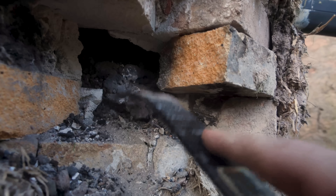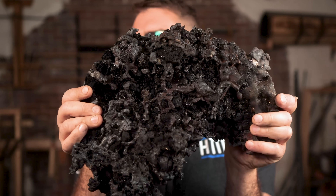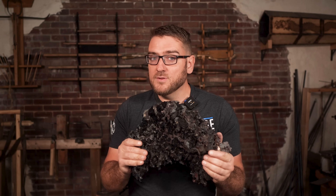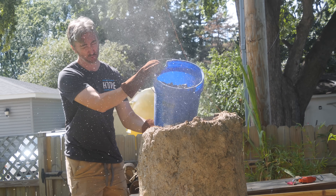We were able to do our first attempt at cast iron, and for the most part it went pretty good, but we did not get a castable result. I dug out the bottom of the cupola and got a mass that's not quite the shape I was going for, but it's definitely something. I think this is all 24 pounds — it all definitely melted and formed together, pretty much completely combined. I think the issue is it got cold at the bottom, but we did reach the necessary temperatures to melt it. The tuyere where the air comes in might be too high, so once the iron gets to the bottom there's not enough airflow to keep it burning. This was our first time using coke, and we were a little concerned it hadn't reached full temperature. We think the metal worked its way to the bottom with coke on top, so the bottom just cooled — if we had tapped it sooner, we might have had a usable casting.